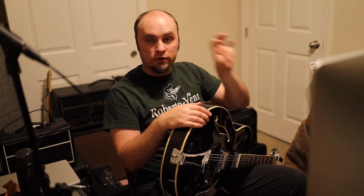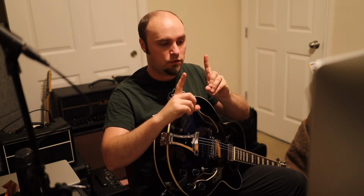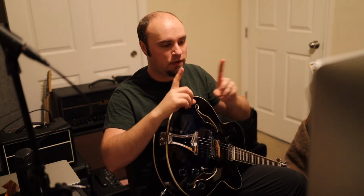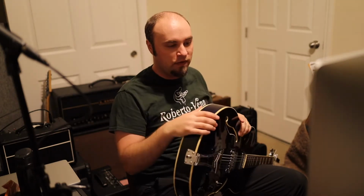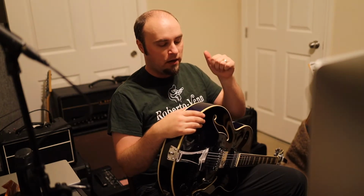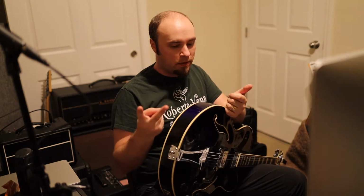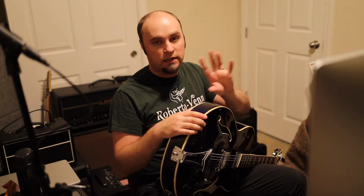So that's taking the alternating current from your wall and turning it into DC. So instead of it doing back and forth alternating, it's then just going to be a continuous line. Because that's what the other tubes would have needed. They would have needed DC. So then you're talking about an output tube, and then maybe a couple of preamp tubes. And then depending on the circuit, you know, you get any number of tubes.